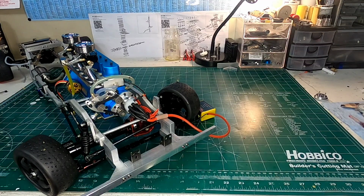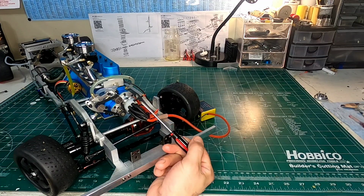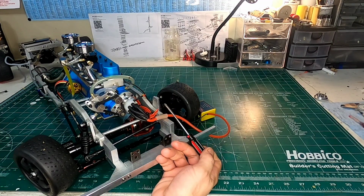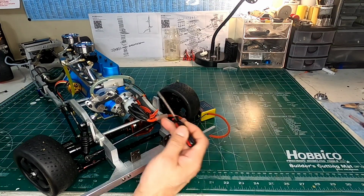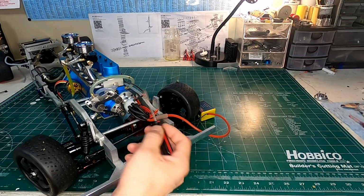Okay, so I just did a video about the Hall effect sensors and soldering them together. I made that video yesterday, I believe. In any case, I started with 4 Hall effect sensors, 2 of the 43s and 2 of the 3144s. None of them really worked. So I just went into the 3144s because I know that they work, and it took a couple, but eventually I found one, and this guy has been working for me all day.